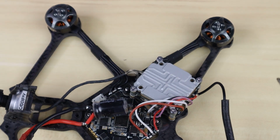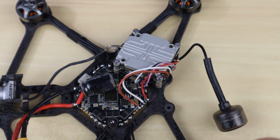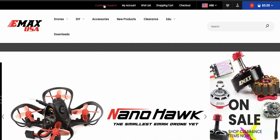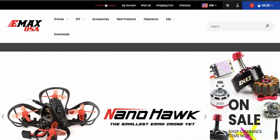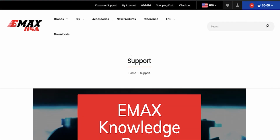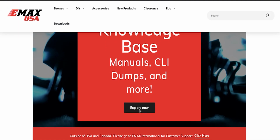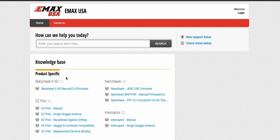Now after you do that, you're gonna wanna go over to EMAX USA, and once here, you're gonna wanna go to the top where it says customer support, and then you're gonna wanna go to our knowledge base, and this is where we're gonna grab and download the CLI command so we can upload it to the drone so all the settings are correct for the DJI FPV transmitter.